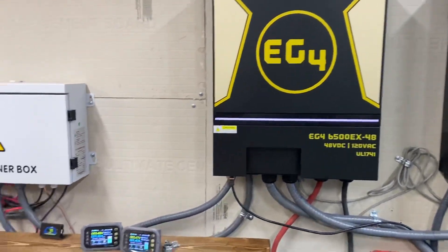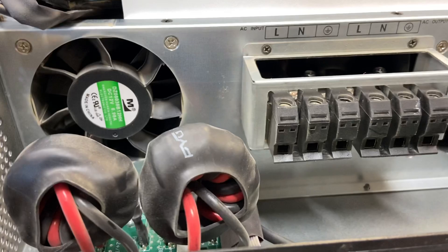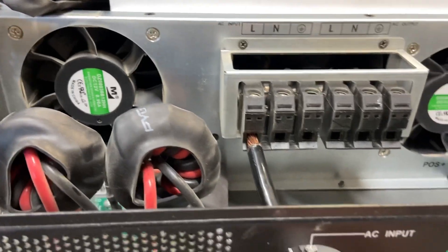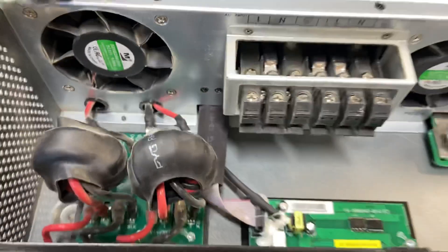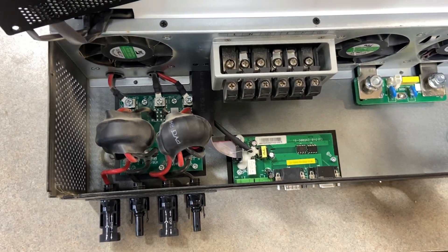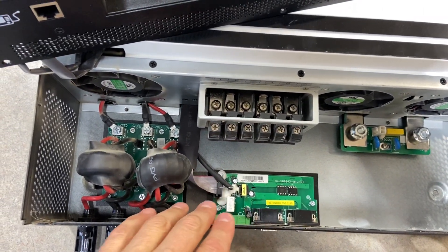I can show you over here the LV6548s — down here we get a look at the terminals. This is four gauge wire and it does fit, but it takes real effort to get it in. This is the way the LVs still come, and the SunGold models and a couple others — Orient Power does one now too. There's a bunch of different manufacturers that use these since it's from Voltronic. But EG4, from what I've seen, is the only one so far that has the larger terminals and the lugs for the ground, so that was nice — during the installation that was much easier.